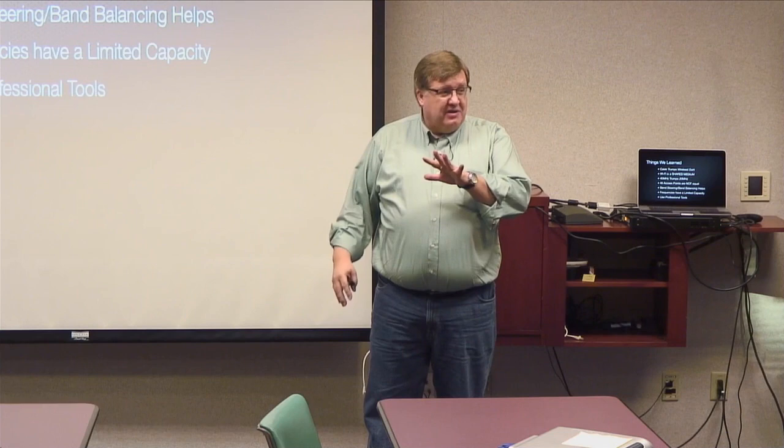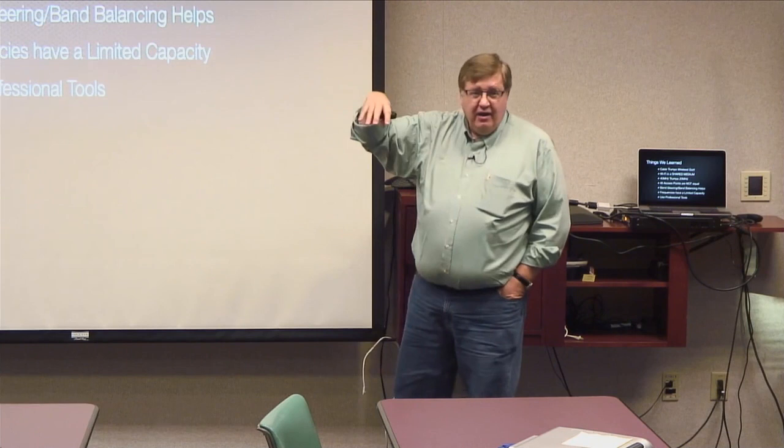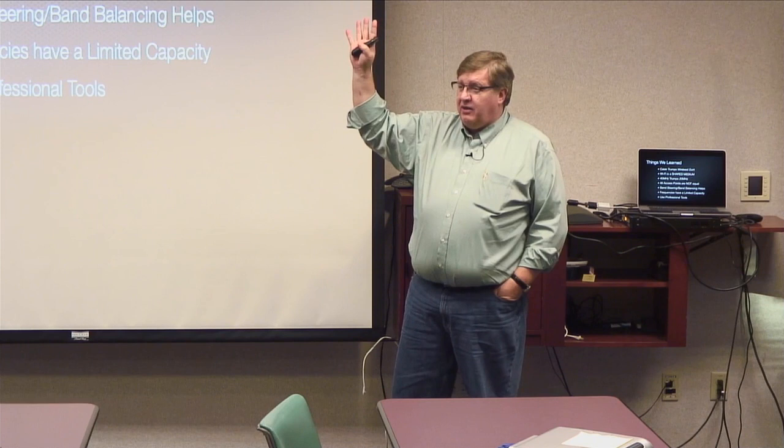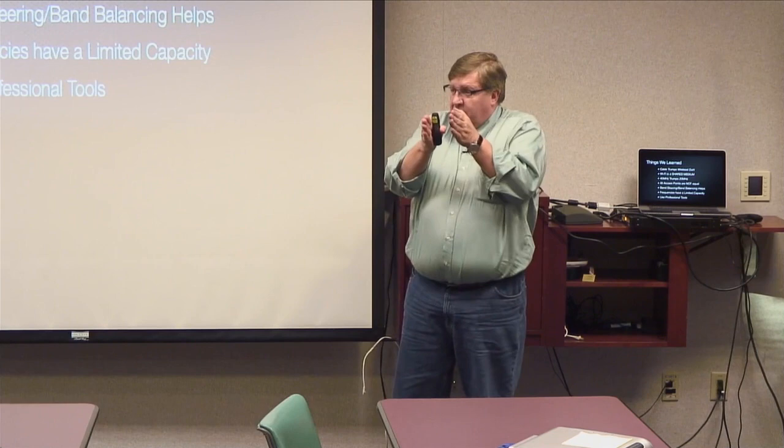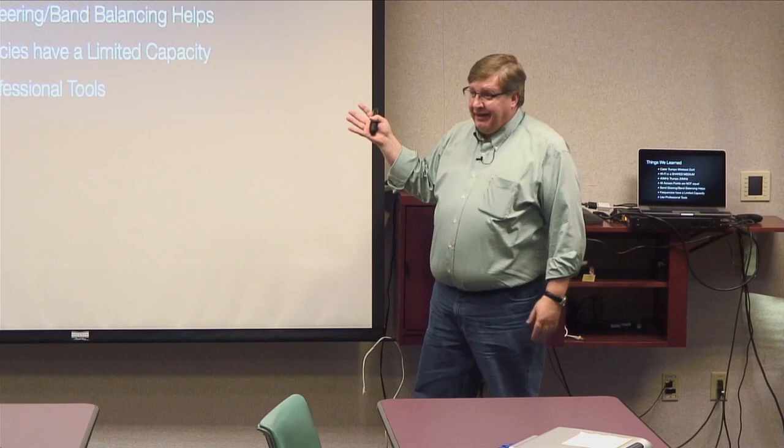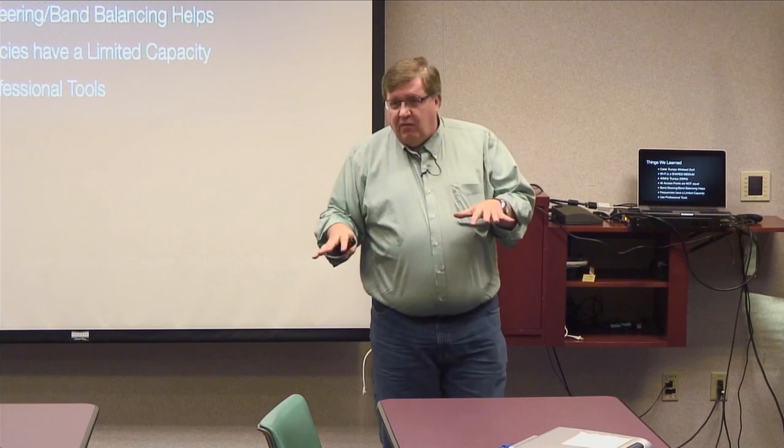40 megahertz trumps 20, another duh, but this changed my mind a lot. I used to be totally pro 20 megahertz channels in 5 gig because I hate co-channel interference. Co-channel interference sucks. It's the hardest thing to get rid of. And so to stay away from it, I just went with 20 megahertz channels. I have more channel choices. I saw so much benefit in 40 that I've changed my mind now. I'm pushing 40 instead.